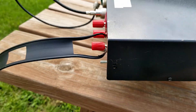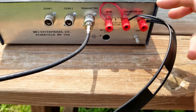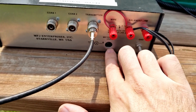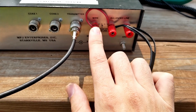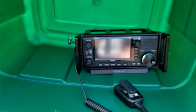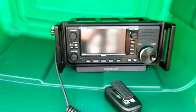In the back we've got a couple of things going on. We have the balanced wire connection here, which is where my 450 ohm ladder line is going in, but you can just as easily use coax and switch between two of those — making it a three-way antenna switch to one radio. It's got the 12 volt DC input, and if you're doing a balanced line then you need to put this jumper in play. We've got the ladder line plugged into the balance line section, coax to the radio, and today's radio of choice is the IC-705. I'm outdoors and it's portable.